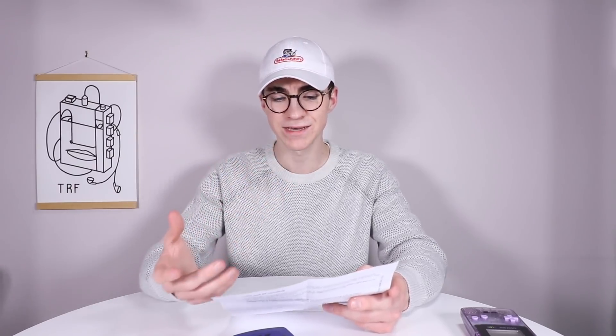It's going to be interesting to see what battery consumption is going to be as well. One thing I should note: hopefully this video has helped anybody who wants to install one of these themselves, but the included guide — although I appreciate that they've included it — it's not fantastic. It doesn't tackle a lot of things you need to know. There are no pictures, only diagrams, and it doesn't tell you how to tuck up the oscillator once it's inside or where's the best place to put it. It also doesn't say anything about cutting the pins from the back of the cart slot. I think maybe this could use a little more attention — maybe they could do an installation guide video.